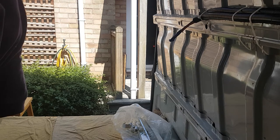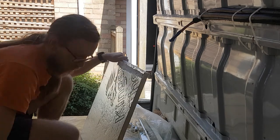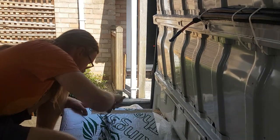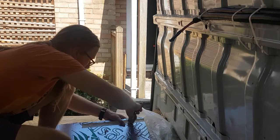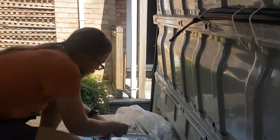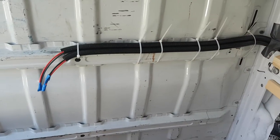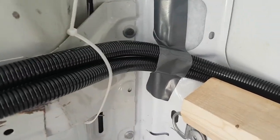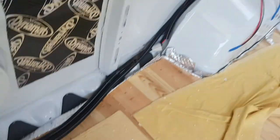You just scrape it out — it's horrible because polystyrene goes everywhere, but I don't think there's a nicer way to cut out a channel. One regret was not giving myself just a bit more space, because there were a few places where I left the channels out, forgetting that while there wasn't pipe there, the cables were still going to have to go through. The cladding was going to be very close to the insulation, so be reasonably generous with your channels. You can always fill gaps with spray foam if you overdid it.